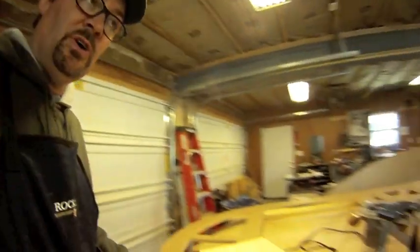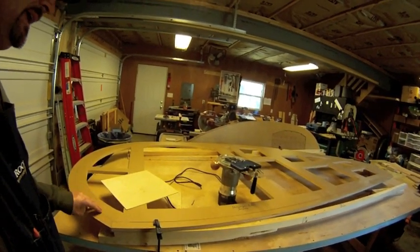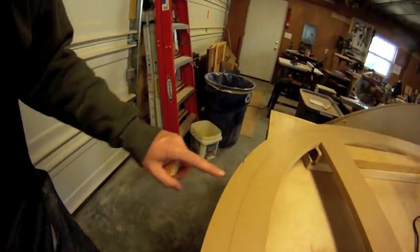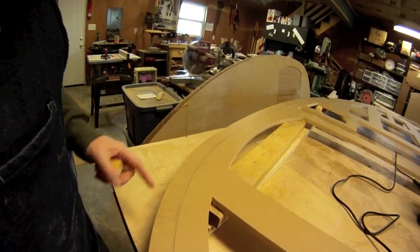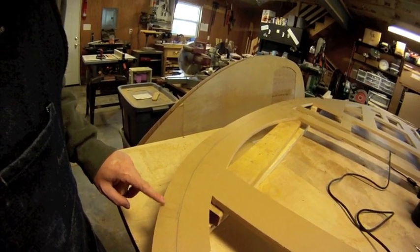The first thing I'm going to do is make the cutouts for my roof and for my ceiling out of the middle section here, and I'm going to show you how I do that. So here's the profile. This is the middle, that MDO plywood that I cut out. You can see I've made some marks here, at about 12-inch intervals. These represent the cross bracing that will hold the two sides up. These will be made of 1x2 lumber that will be laminated together.